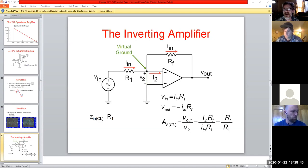And then we look at, okay, how do we arrive at a formula for our overall gain? And again, the transfer function for these things is always your voltage out compared to your voltage in. It's just how you arrive at that. Well, in this particular case, what are we going to look at, right? We set what our voltage out is and we set what our voltage in is, and we end up dividing those two out, and we come up with this little golden rule. And this is always the case where the AV of an inverting amplifier is always equal to minus RF over RI, right? So your feedback to your input resistor ratio, inverted. So depending on what your resistor values are, that'll determine what the AV of the circuit is going to be.